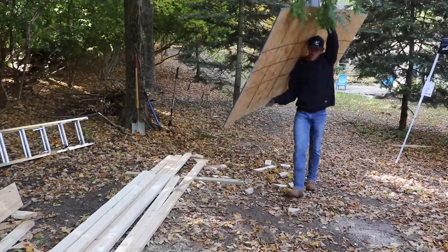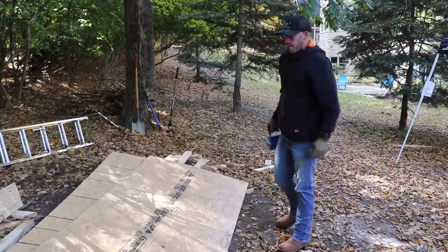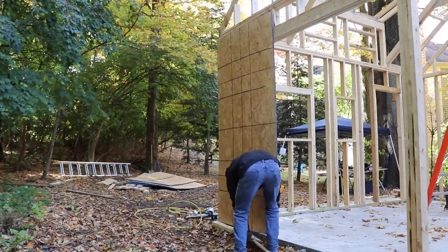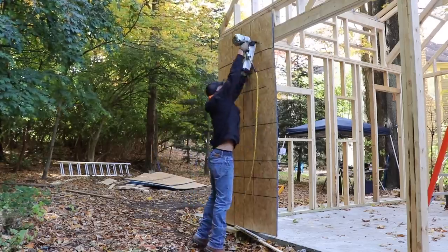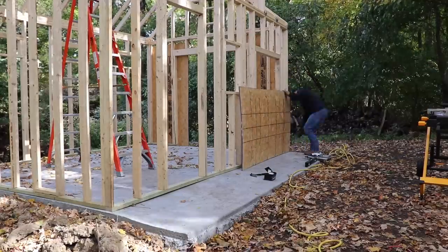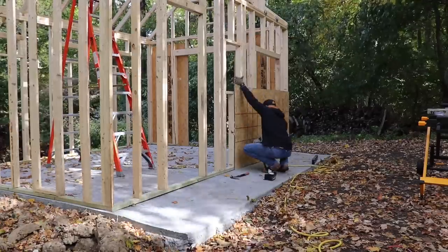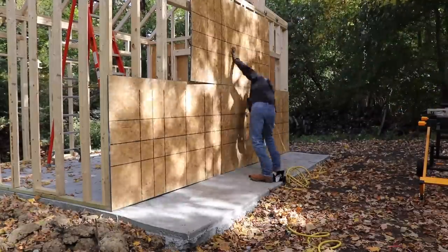The really cool part about this camp house shed being tucked away in the back corner is that it will be secluded. The bad part: hauling material — especially what will be 36 sheets of half-inch OSB. To get the first panel straight, I piled up what is essentially garbage on the ground until it was close enough to fire in a couple of nails. I tried to leave a small gap between the slab and the bottom of the OSB around the perimeter. For the long walls, I made sure the bottom row of sheathing was level so the next rows could reference directly off them, staggering seams of the panels for maximum strength.